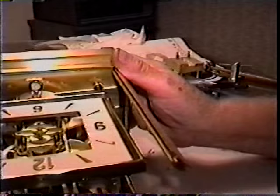And then on a dial plate, there are four screws, and they're on pillar posts. So it's a good idea to mark the top, put a little scribe mark up at the top signifying what end it goes on, so you put it on in the right manner. Loosen all these screws off. Even the screws underneath the dial are nice and polished. Very, very elegant piece. I think Atmos did a super job on building this clock.